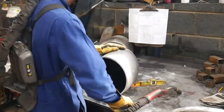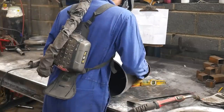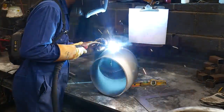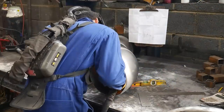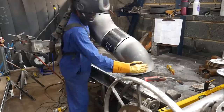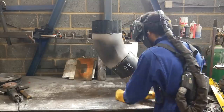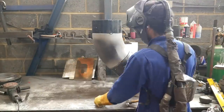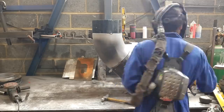I tack it all together on the table and then I stand it up so I can level it off, making sure that the 45s are level, that the sliver of pipe on the end is level, and that the set is the right measurement. That's why I use my big square — it's basically the same as measuring top to top, which gives you the center-to-center mark.